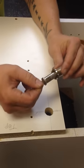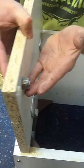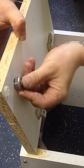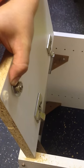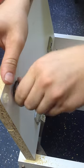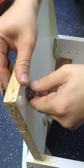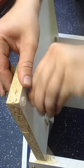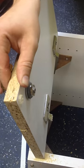The lock is assembled. You just put the key in, drop the lock through the hole, and open the door. You have this little collar — put the collar on it like so. And then you have your washer and nut — tighten that down. This is where you'll need the adjustable wrench to tighten this down. I'm just going to hand tighten it for now.